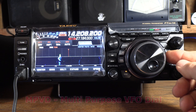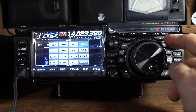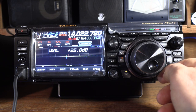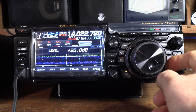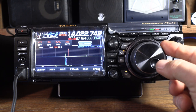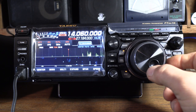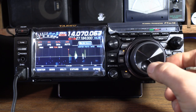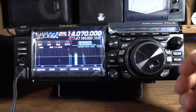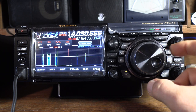On the Yaesu, there's an outer tuning dial — a multi-purpose outer dial with a four-letter acronym — and you can assign it to a bunch of different things by pressing a button. Press band and you move around the bands; press mode and you move around the modes. With the custom select switch you can assign anything you want to it. I keep the fine button on for the main dial, giving me single-hertz increments, while the outer ring has a much faster tuning rate — right now 100 Hz on the outer ring and 1 Hz on the main tuning dial. In combination they work pretty well.